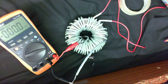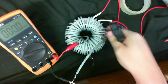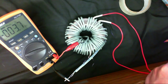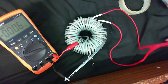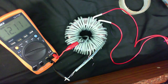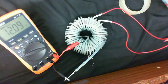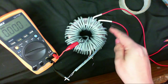And this is the transformer that's going to power the filament of the GU-81. It's a toroid transformer where I've taken the secondary off and wound my own secondary on. I just took a whole bunch of wire and wound it on there, so I don't know what the voltage is going to be. I'm going to plug this in now and let's see what voltage we've got. Okay, we've got about 12.1 volts. So I'm real close — I just need to put a few more windings on this, and then we'll see if this will power up the filament of that GU-81.